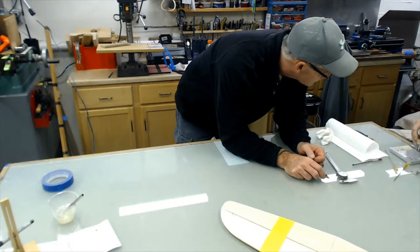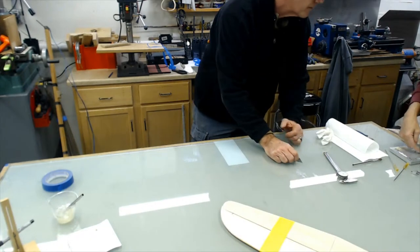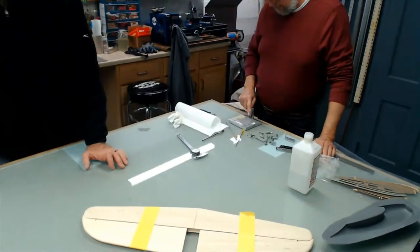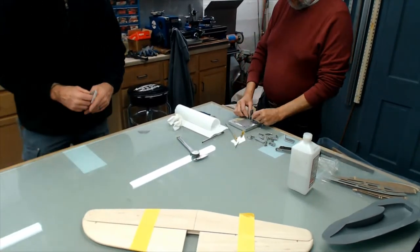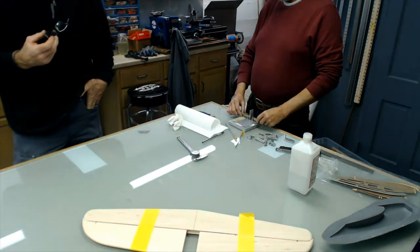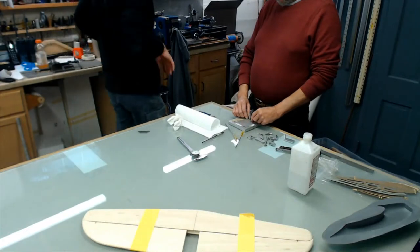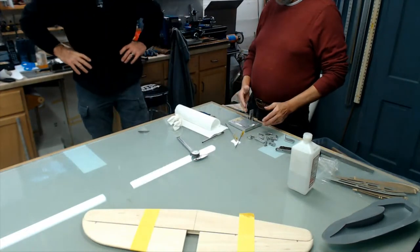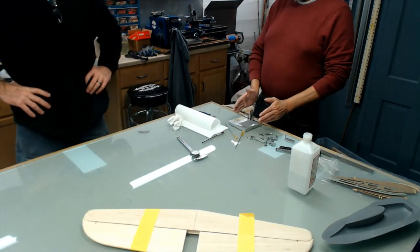Now you can drill these holes. You just get a plate of aluminum and grind this right out to get the pivot point clearance down there, and you could put these holes wherever you want. Now what I want to do is make it where these pins will screw in and out, on a slider block in there, and then I could individually adjust them if you wanted an offset. Oh, yeah. Push rod, you adjust this one out and this one in.